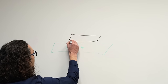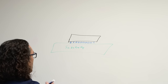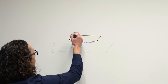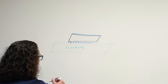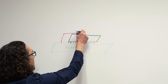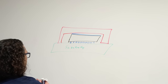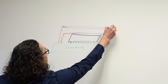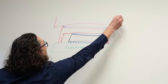So we've got the substrate, which is the PCB that has all the routing on it. And then our silicon die sitting on top of that — I'll draw it thick because we're going to draw some pictures in there in a minute. We've got die attach, which is a very small ball grid array — not quite a BGA but it attaches to the substrate. And then with our desktop parts, we've got the thermal interface material sitting here. This would have been the polymer TIM, then the solder TIM. And then we've got our IHS sitting on top of that, and finally another layer of thermal interface material, and then at the very top we have our desktop thermal solution.